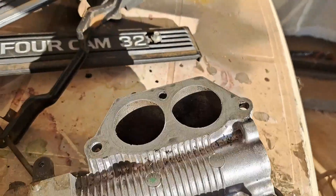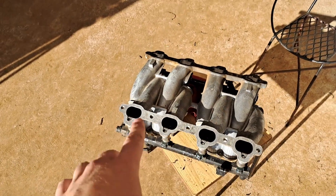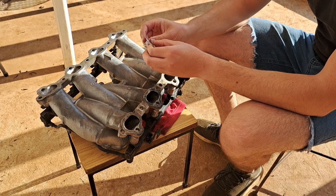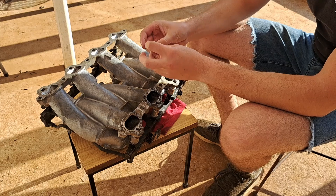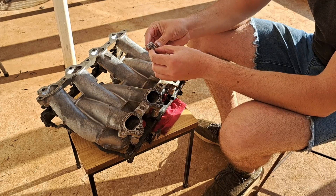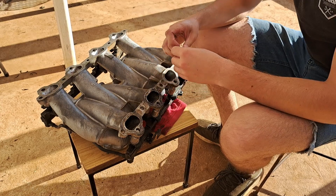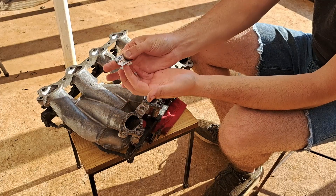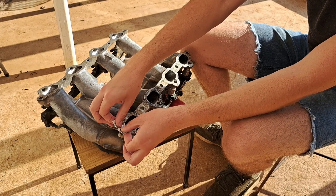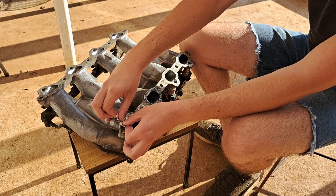I've gone ahead and cleaned up all of the other surfaces on the components just to figure out how to do it properly before I record it and explain to you guys. You want to start by taking your Minora blade — or razor blade if you don't have those — and fold your wax paper over the edge you'll be holding, because these things are quite sharp. Then you want to start by just twisting it a little bit, put some tension on the part where it will meet with the material, and applying slight pressure, keeping it at about a 10 degree angle against the surface. You just sort of scrape, almost like you are shaving.